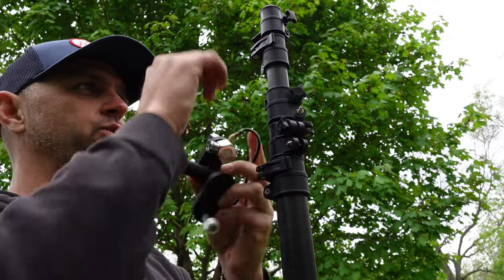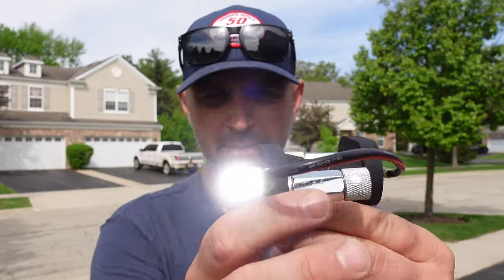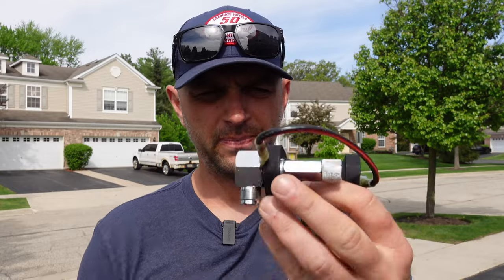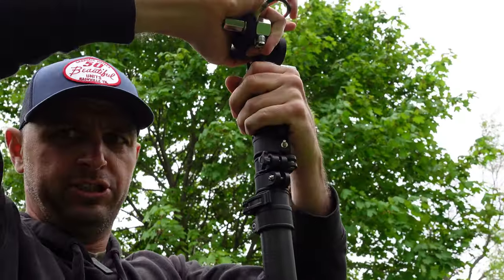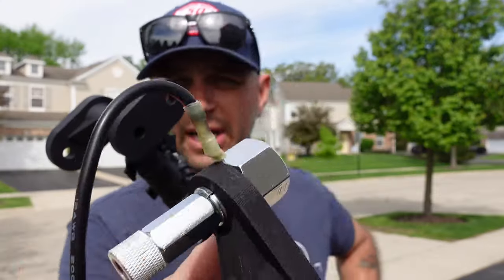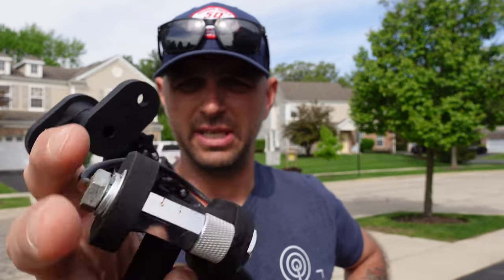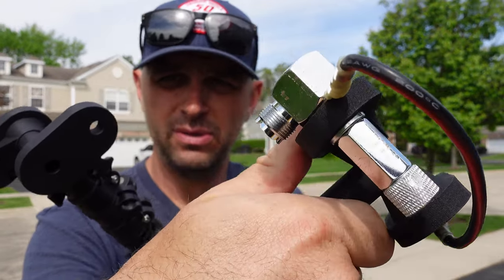This is where it gets fun for me because I get to design stuff. Originally, we created a topper — it was a collaboration — that looked like this. It had basically two holes, and you'd jump a wire across to make a dipole. A hamstick would go on each end, and then you had your SO-239 or coax cable coming down.